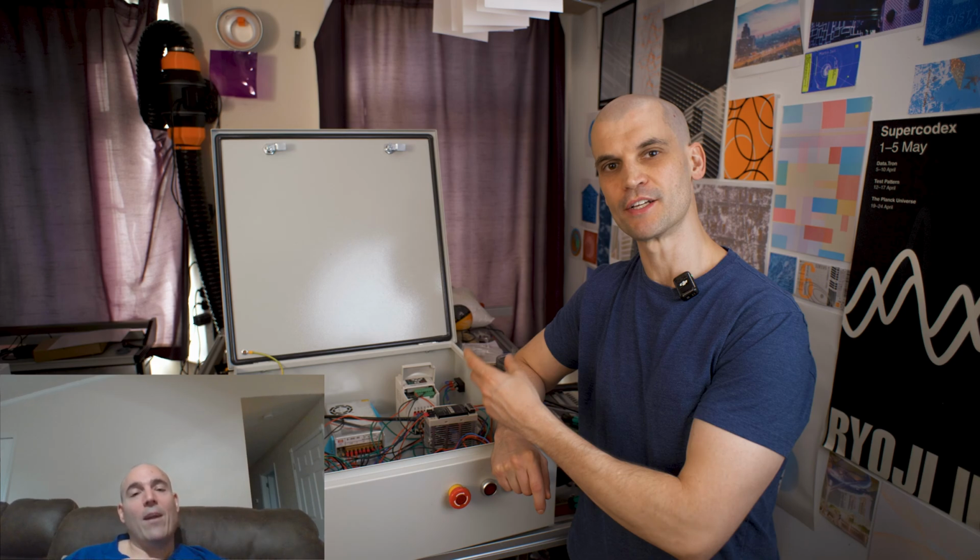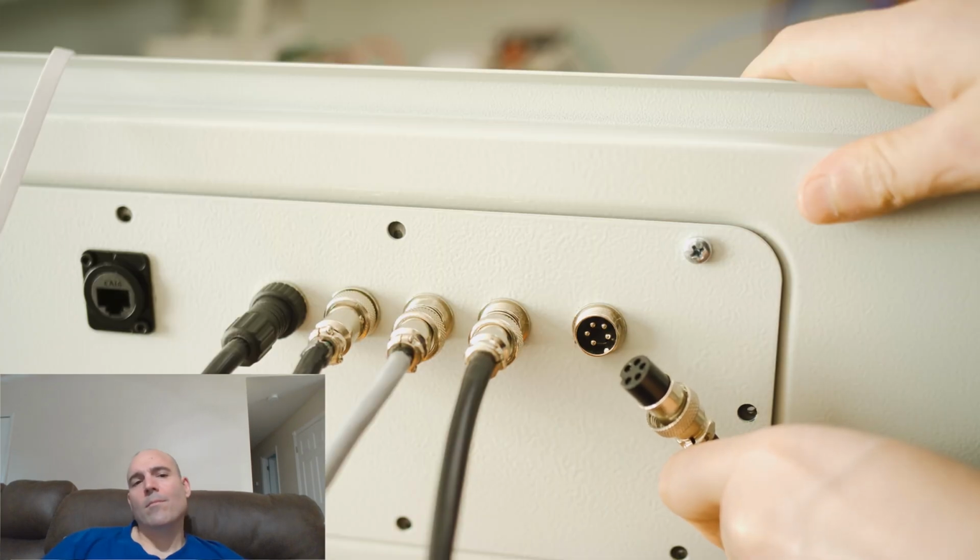I prefer ring connectors. Why? Because you have more conductive surface. More conductive surface means less problems with resistance, because again, we have a larger amount of material that's conductive. Once again, large amount of conductive material, less resistance. Smaller amount of conductive material, more resistance. This is fact. The other principle is to use GX connections.